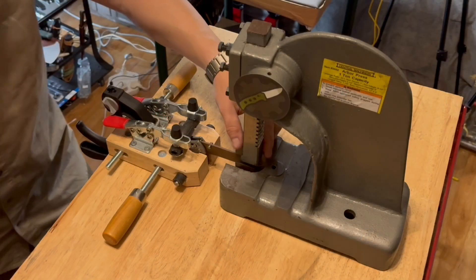Some people argue that heat treat is not the most important thing about the blade, but let me tell you — it does help, because you can sharpen a properly heat-treated blade a lot better. The finish on the blade is some kind of deposited phosphate bronze finish, potentially mixed with Cerakote. And before I strip it off, I would like to test the tang of the blade with my portable tester.